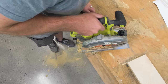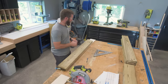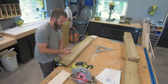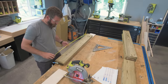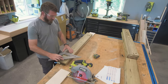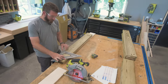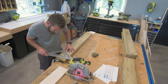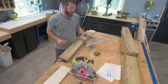On the first two boards, we're going to be using those as the long leg. I've already cut that 20-degree angle on one end, and we're going to measure over from there 38 and a half inches, then make a mark and cut a 35-degree angle. We're going to mark that the same way with the speed square, set the pivot point right on our end, come over to 35 degrees, mark it, and then cut it with the circular saw.